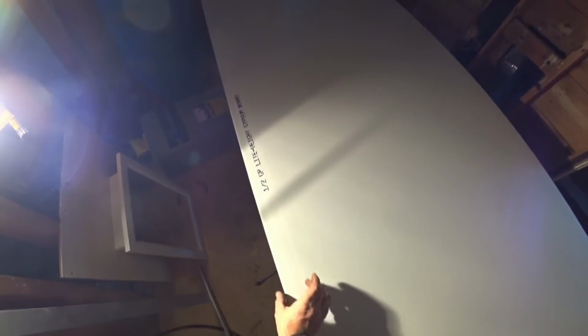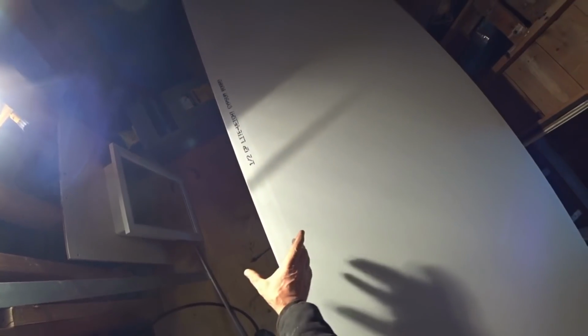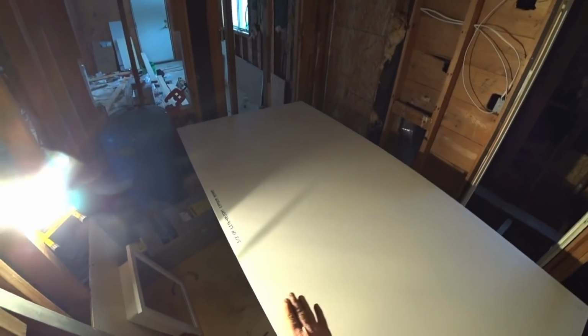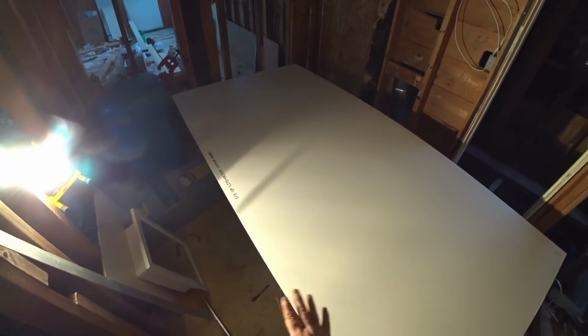It's like a white paste, and you put it on a spatula, a spreader, and you put tape on the seam, and then you go down and you spread it out. And that's how wide it is. The spreaders are usually this wide. And you can just go down and spread the mud right through there. What you're trying to do is fill in that void to cover up screws and all this stuff in the joints.